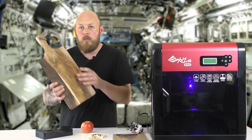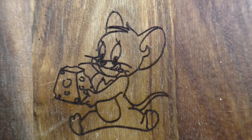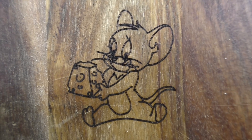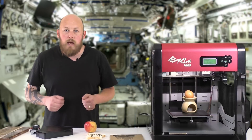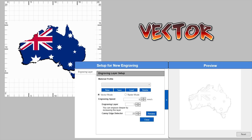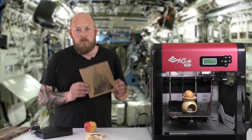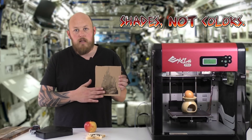Here is a chopping board which I engraved with Jerry off Tom and Jerry. This is actually a cheese board so there's a little picture of cheese. The two main modes in the software are raster and vector. Vector is the one that does the outline and you can tell it how many passes you want to do over each line to make the etch deeper and deeper. Raster is the actual engraver — that'll give you your output variation, do full shapes, and give you colour gradients.